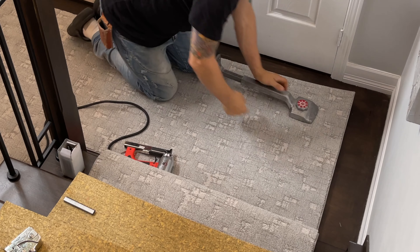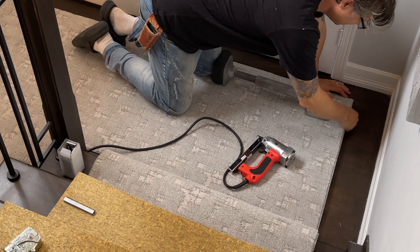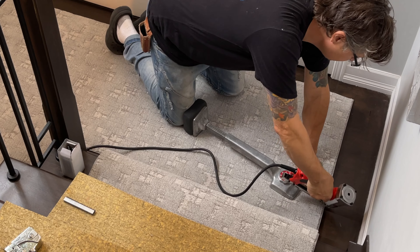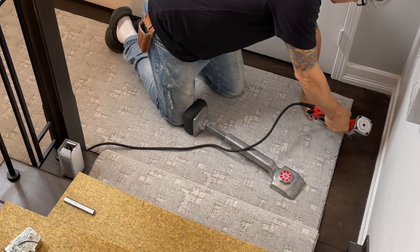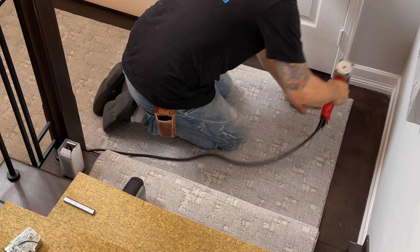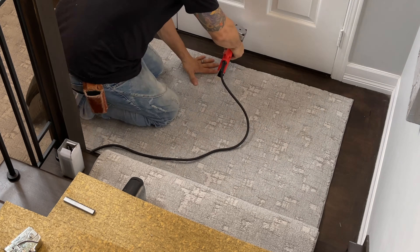You can see how I tweaked it with the kicker — I'm following my lines to make sure I'm on course. I'll pop a staple in at the corner to lock it in and make sure I'm happy, because now I have to match the carpet going up the stairs. From this point of view you can see it's perfectly straight. Not all houses are going to be straight — not all houses are built equal. I've had lots of jobs where walls are not straight and you just have to make it work.